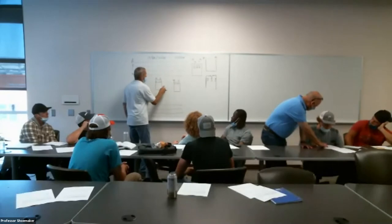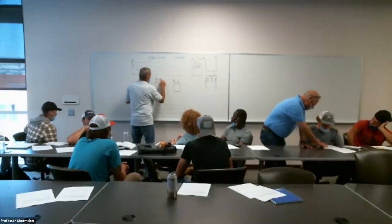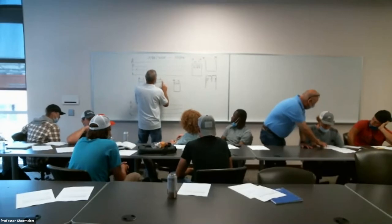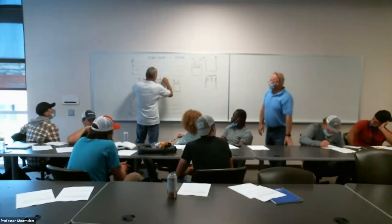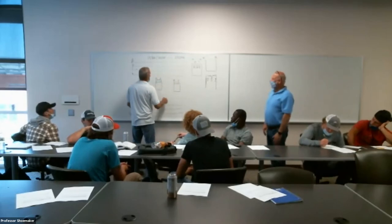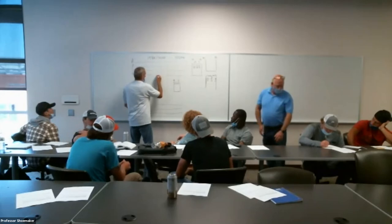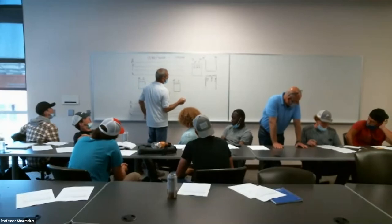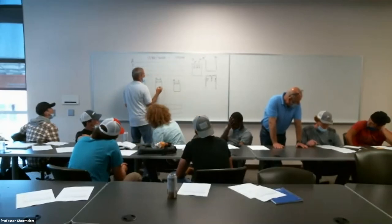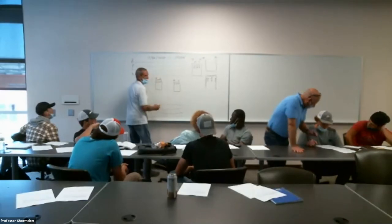When you're doing your drawings here, think of the lids of the transformer. Everything from that point goes up. Right? Everything from the secondary bushings here goes down. I saw some drawings right here where I have phase going from here to the secondary. Well, that's going to be a massive explosion. Right? That's just not going to work. Or the neutral came from here and went down.